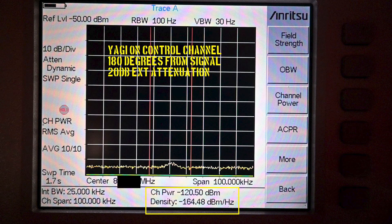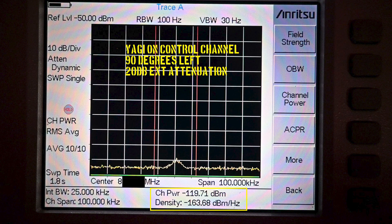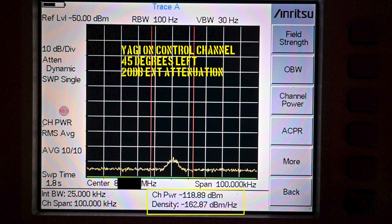For the off-target direction, you would only be looking at a noise floor with a numerical channel power value within the ability of the instrument to resolve. For the purposes of our test today, we are going to minimize attenuation so we can see a level of directivity that we can actually measure to a degree, and of course we will average these results and discuss them after.